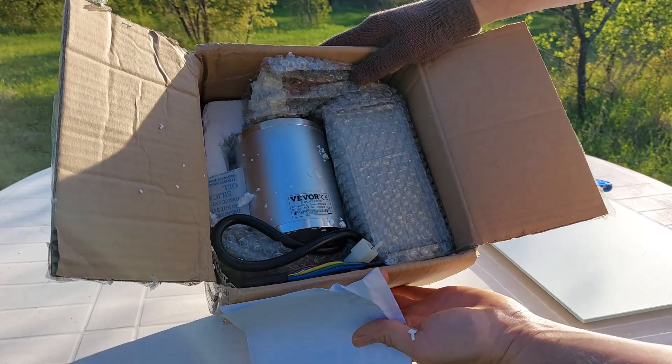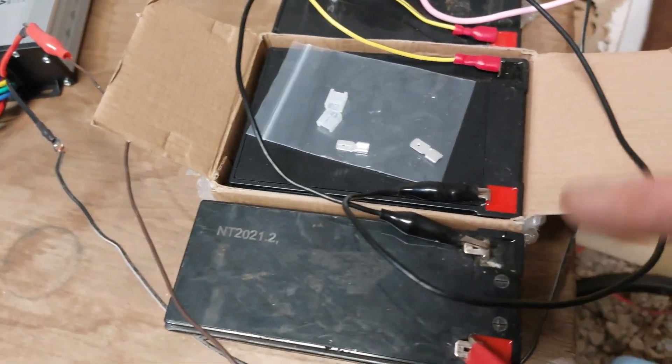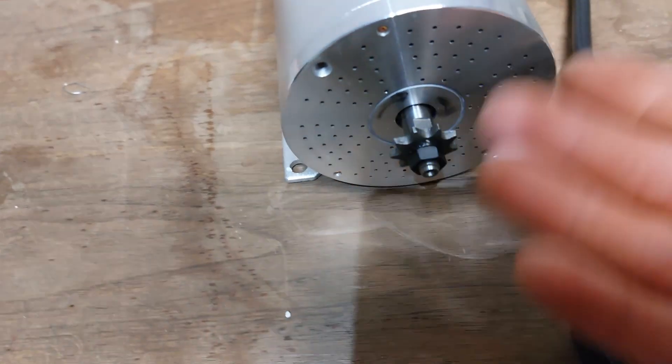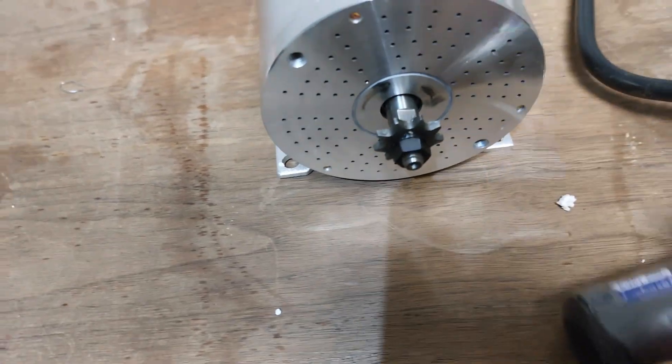For the motor and controller wiring it's negative, positive, negative, positive, negative, positive all the way along. Before you turn on your motor you should always give it a spin to see if it's moving freely, because you don't want to fry the controller if there's something wrong with the motor.